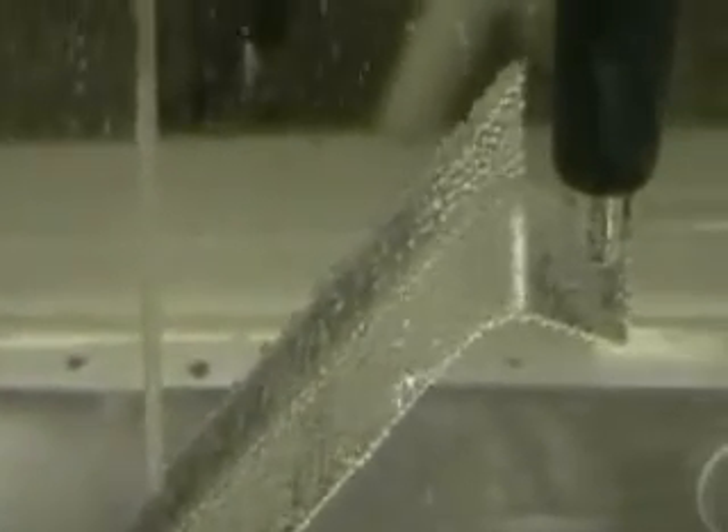This is what we get with just going across the top. You can see the bubbles coming up there between the two. The question was: do you actually need any width on the plate at all? In my estimation, there's going to be a formula that allows you to have just enough — just wide enough and just deep enough.